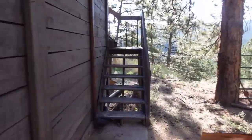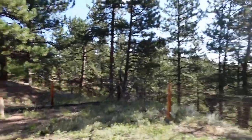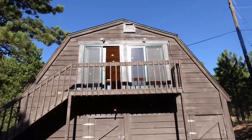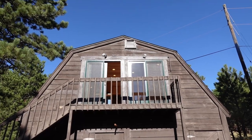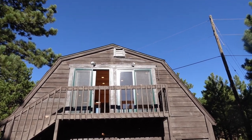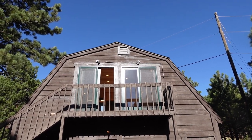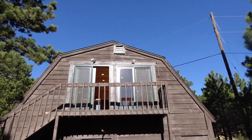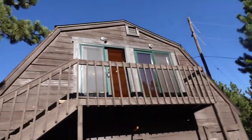All right, so let's go inside and take a look. Well, actually, they'll bring you around here first. When we were gutting the place, it became apparent that the original sliding doors had to go. They were not easily removed from their frames, and underneath the sill area had completely rotted out. So we got these nice new wood, aluminum cased sliding patio doors, reframed new openings, retrimmed everything, put in flashing up above the trim, and rebuilt the whole sill area, which I'll show you as we walk up there.